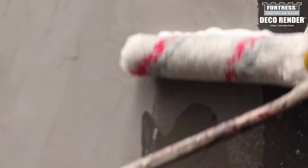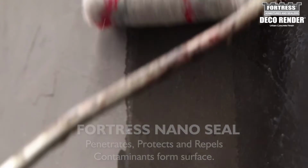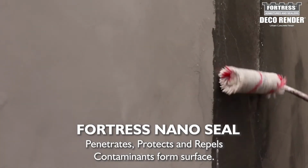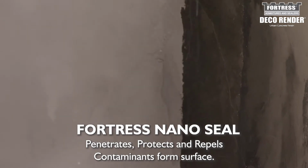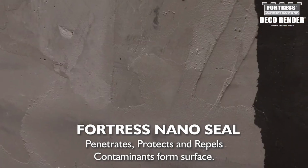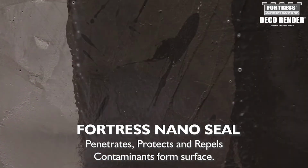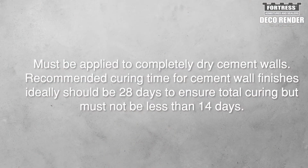For outdoor installation, we highly recommend using a sealer. Fortress NANO Sealer is a water-based penetrating protectant and has a higher solid content to allow greater water resistance. Must be applied on completely dry cement walls.